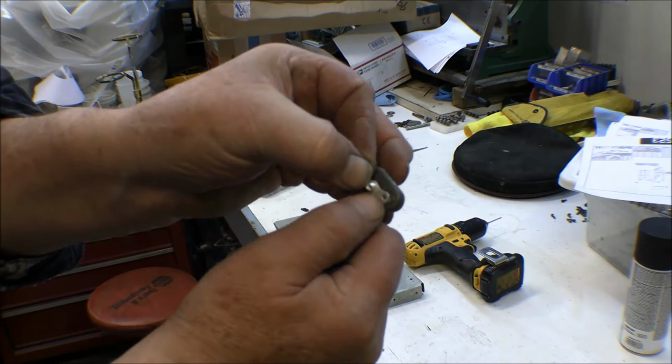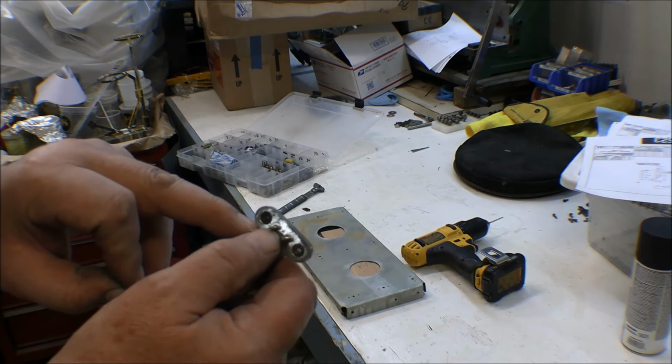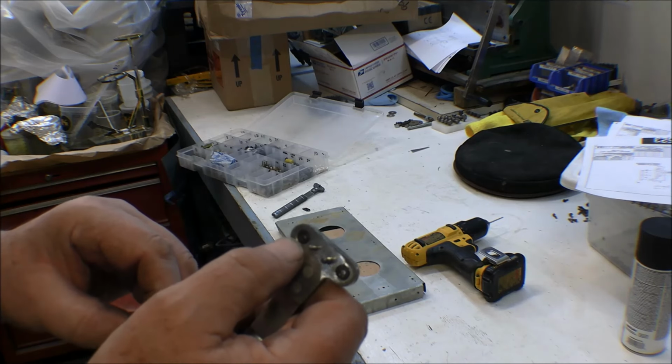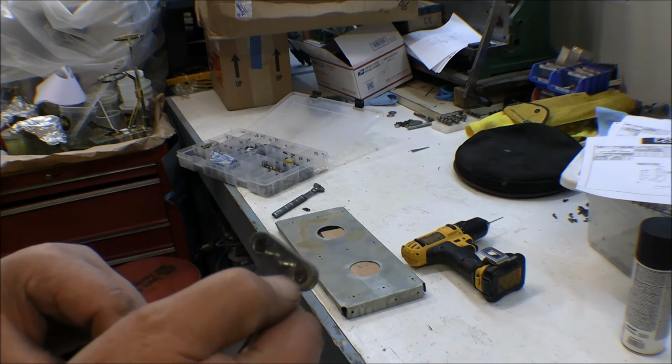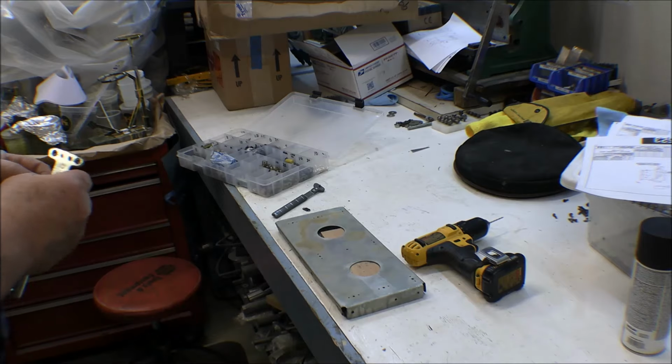and then you drill the first hole through the bushing, and you turn it over and line up this pin and this pin in the holes that are there, and then you can use that bushing to drill the second hole, or you can use this bushing here to drill another hole for a two-legged ear, a butterfly ear, whatever you want to call it.